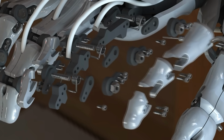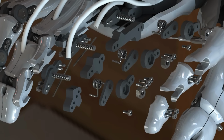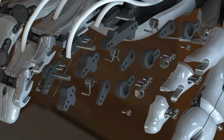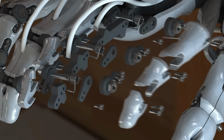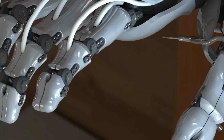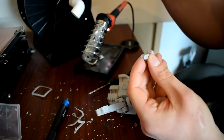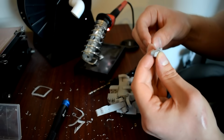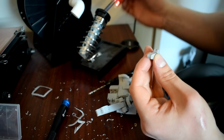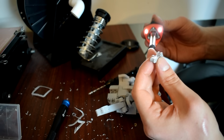It's just because I had this really weird idea of how strong 3D printed parts were, based on the sort of bad experiences that I'd had with my cheap printer, which is now running a lot better because of some upgrades I've made. It's also just because I wanted it to be as strong as it possibly could be, and I didn't really realise that PLA can actually be really strong. But when I was designing it, I made it so that very few parts that I printed would have any sort of holes running through any side faces, and the vast majority of the holes would just be up through the Z-axis of the 3D printer.